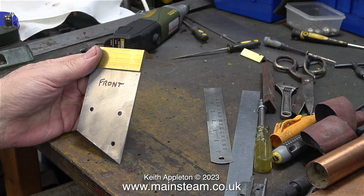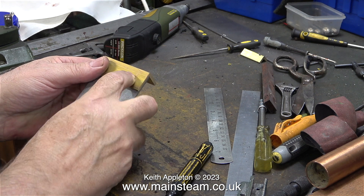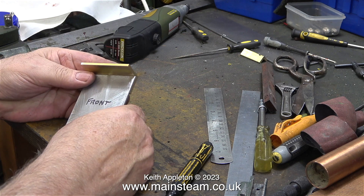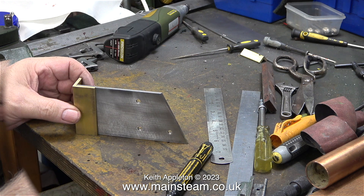Over now to the workbench to start the process of fitting the pieces of brass to the pieces of steel. There are many ways I could fix this piece of brass angle to the top of the piece of steel — I could thread the brass and screw a bolt through from the other side, or I could rivet the brass angle to the piece of steel — but I've decided to use nuts and bolts: 2BA nuts and bolts to be exact.